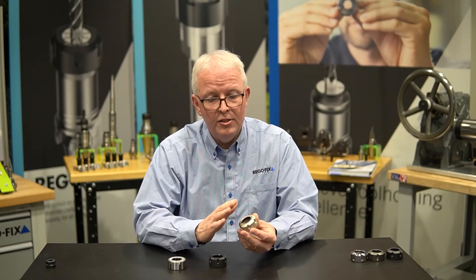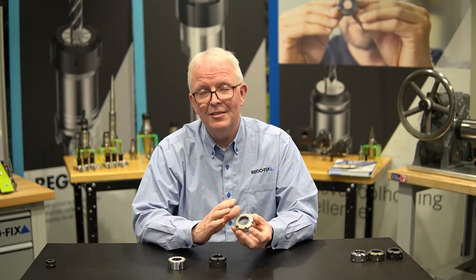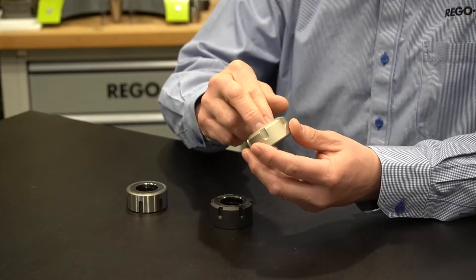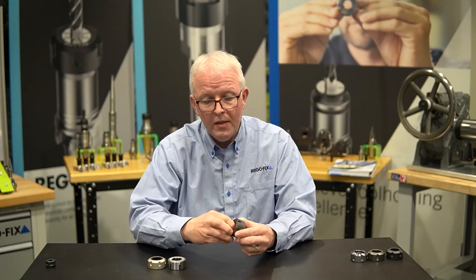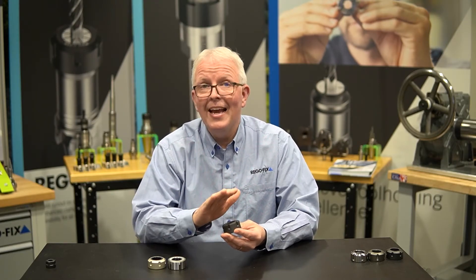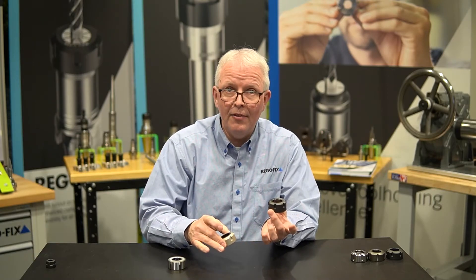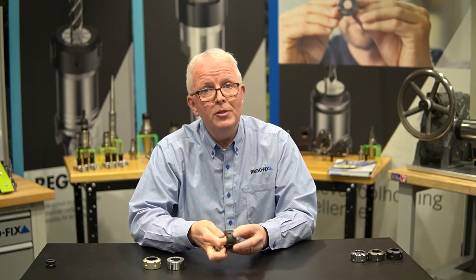The same goes for the cheaper slip ring style. It's a much looser fit — it acts kind of like a friction bearing, but not quite the same. Does it rotate freely, or are you having to really drive it around? If it's putting up any kind of resistance, it's time to replace that nut. With the RegoFix friction bearing nut, it's the same thing — does it turn freely, is there any resistance? The good thing about the slip fit and the friction bearing style is you can put these in an ultrasonic machine and clean them, clearing out all the small crevices and pockets. You really don't want to do that with a ball bearing style because it'll clean the grease out. If it's still free rotating and spins freely, it's good to go back into operation.